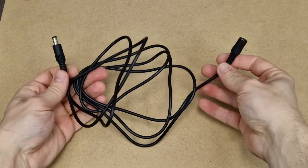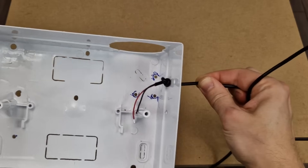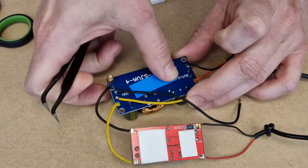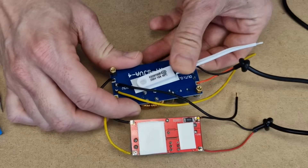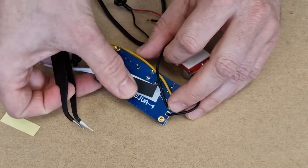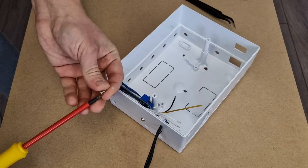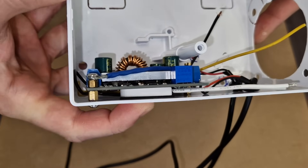I bought these extension cables with 5.5mm connectors. I will cut a piece from them and use it to power the devices. I tied the nut on the cable inside the UPS so I wouldn't accidentally pull it out. On the back of the converter board I will add a normally-open thermal switch — if the converter heats up to more than 40°C, which should not happen with 250mA, the switch will turn on the cooling fan. I will stick the switch to the circuit board with thermal adhesive tape, and place a piece of 1mm foam tape between the thermal switch and the side panel.